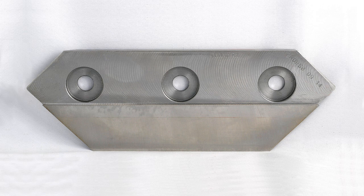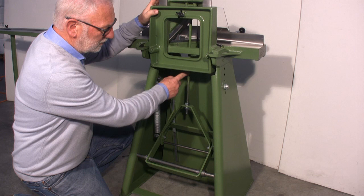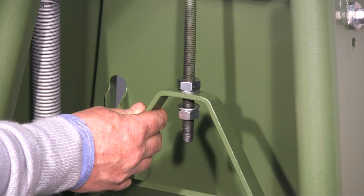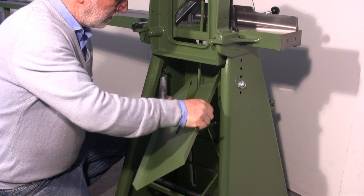When the blades are sharpened, their height is reduced by about 1mm. If they become too short, you have to lower the cutting block — otherwise the blades won't be able to cut the moulding completely. You have to move the threaded rod: unscrew the nut whilst holding the cutting block still with the other hand, then lower the cutting block and screw the nut. Fix the nuts well, and at the end put back the slide for the chippings.